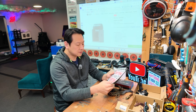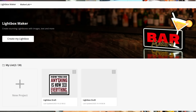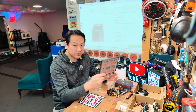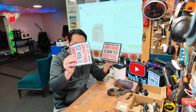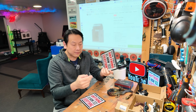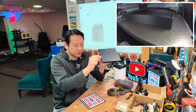Next, the multi-color prints using the AMS — again the 0.4mm nozzle. This is actually a failed print but I made something of it. I'm making light boxes like this. I used the light box maker on Maker's World, which is a bit confusing if you're new. Because the AMS has four colors, when you import the model it asks you to sync the AMS with your actual printer. For some reason I got it wrong — the white and gray colors look very similar on screen. By the time the front panel finished, I realized I'd printed in gray instead of white, so the light is really hard to come through.